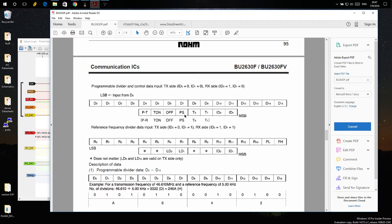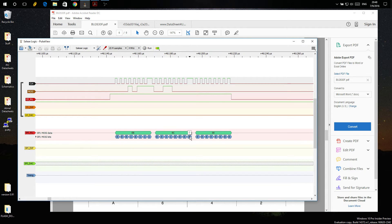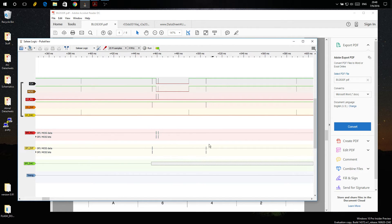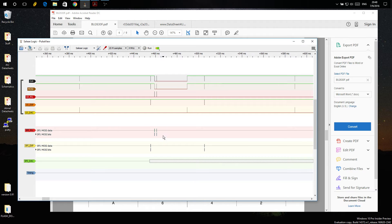The other various options I haven't quite figured out — things like phase — are all zeros as well. The radio sends all zeros, so we're not doing anything fancy with these registers; we're just leaving them all zero. Then of course we have the 16-bit programmable divider input — two bytes right here: E8 and 0C. When we change channels, only those two bytes are going to effectively change. After the channel change we set the mode, change the frequency divider, and then set the mode again — multiple times, which I'll eventually figure out why.